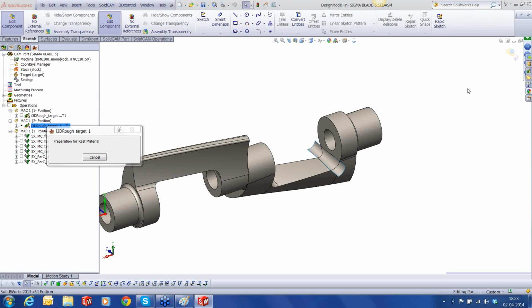So that's one of the prime reasons why we use iMachining nowadays for most of our roughing work, provided, of course, there's a catch here, provided the part is a moderately small part. I mean, it's not a huge part, like a 1 meter, 2 meters long part and a deep part, wherein our end mills cannot be used.